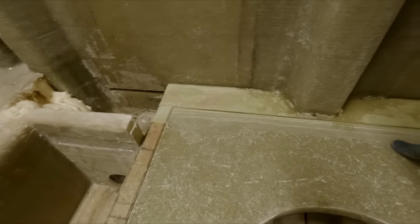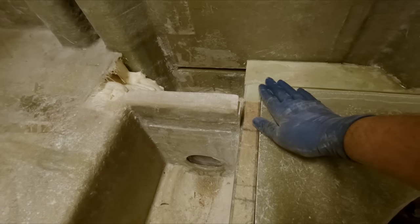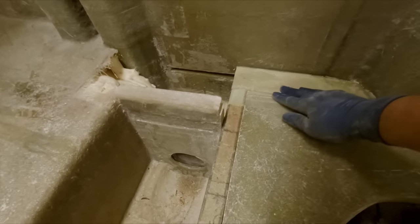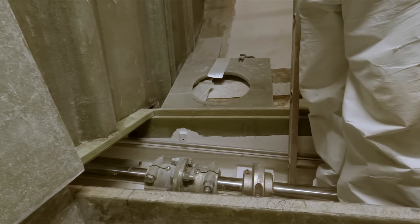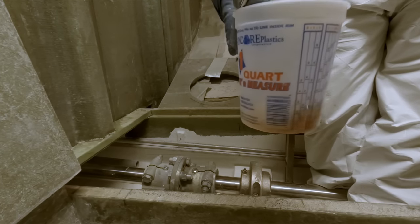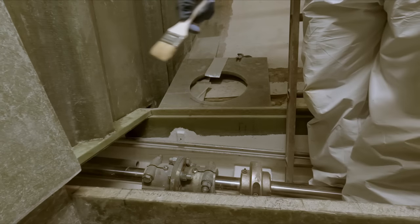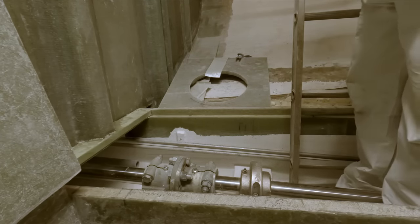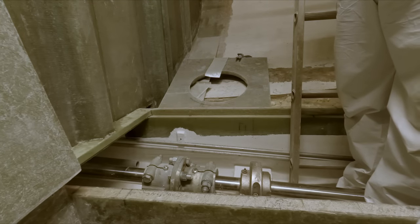This was added a little bit later so it didn't have the same thickness of glass, so that just zipped off a little bit of that glass, and we'll lay a few layers, probably the same layup schedule, to connect those two and tie them together. Got a little bit of resin here, wet out our edges, the foam and the laminations here. Dad's up top fixing some putty, and we'll get this thing into place.